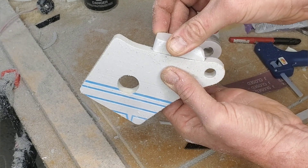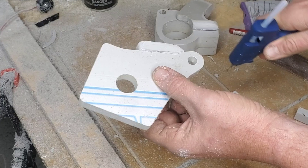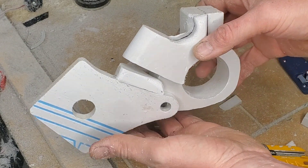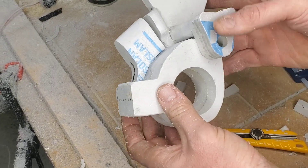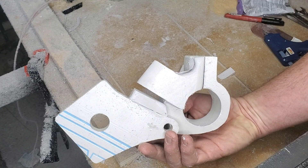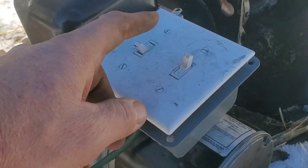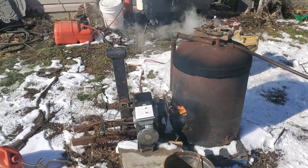Let's blend some of the stuff together and give it a really good look over. I'm really glad I did this lost foam casting and built the model first because it caught a lot of problems. Now the only thing I have to do is glue on this little mushroom piece — that's where all the molten aluminum is going to come in. Speaking of molten aluminum, I better get out to the yard and start melting everything down. If you haven't checked out the oil burner video, check that one out — it's a really easy way to get molten aluminum super quick without building anything complicated.